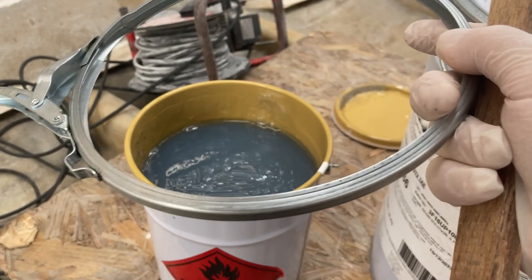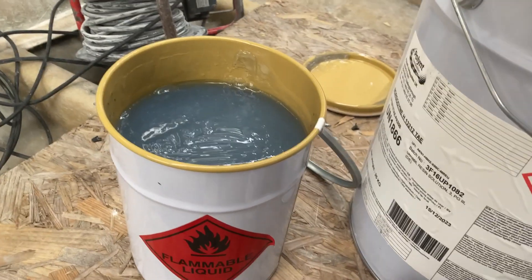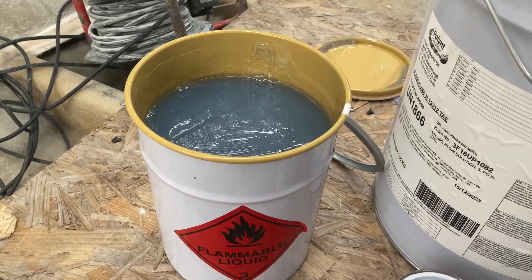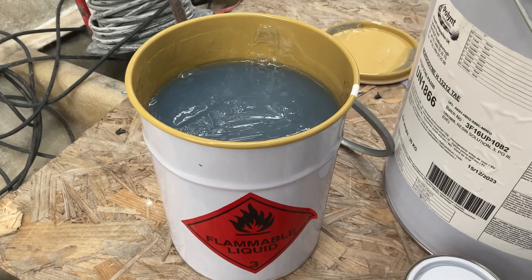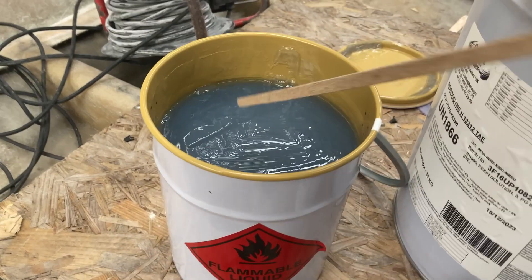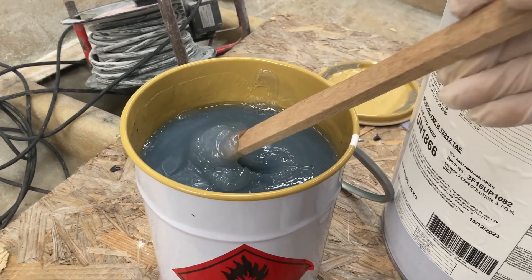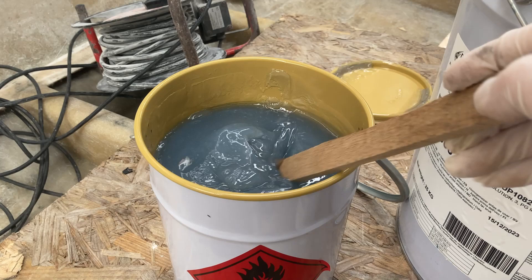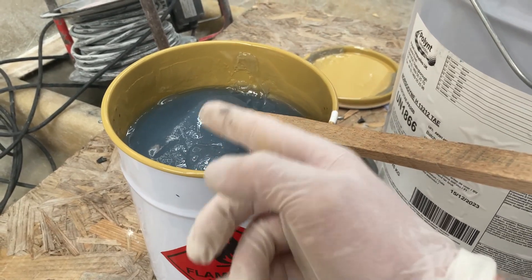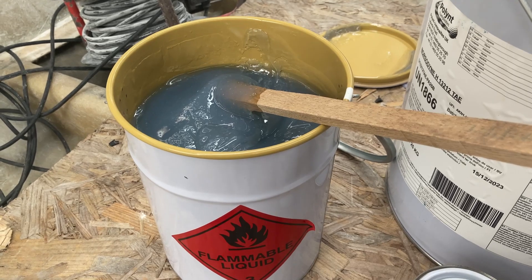Most tins of flow coat have these rings around them — you just break the little plastic clip and pull off the ring. This important thing is: flow coat needs to be stirred well. It's flow coat and not gel coat, so that means it's got a wax additive. If you put gel coat straight on the boat, that wouldn't dry because it needs the air taken away. Flow coat is just gel coat with a wax additive — the wax rises to the surface, seals it off from the air, and then it cures. So if your wax and your storing agent have dropped to the bottom and you don't bother stirring it up when you mix and paint it on, if there's no wax in it, that can't go to the surface. So it's never going to cure and that will stay tacky forever — that would be a nightmare.